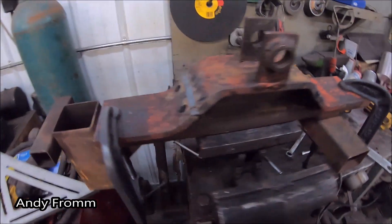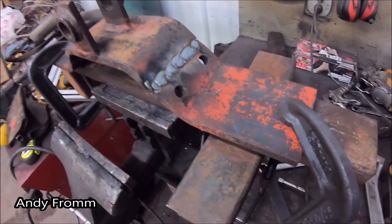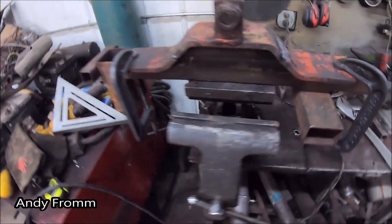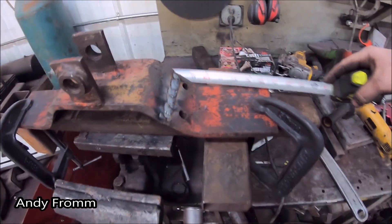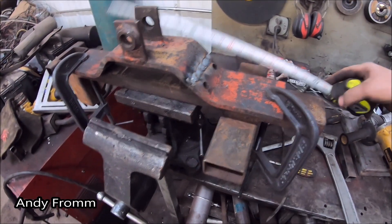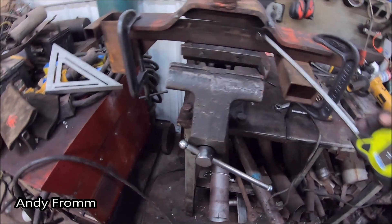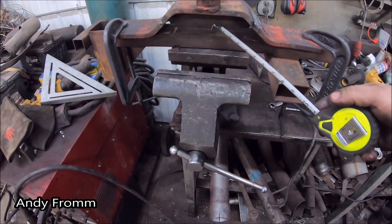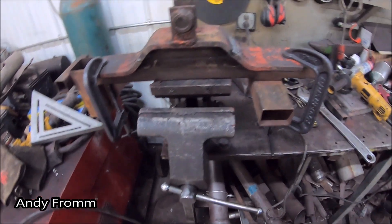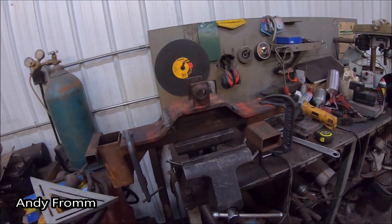Here's what I got so far. It's pretty well welded up. Got to fill in the holes and touch it up a little bit. With shortening this, we are about an inch wide. And between this surface and here it's two and a half inches, which puts this surface in here about four and three quarters. That's the best I could determine off my measurements.